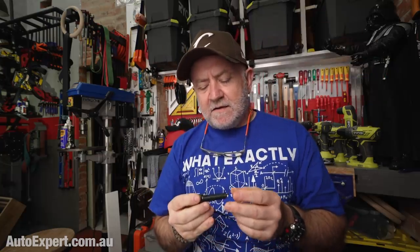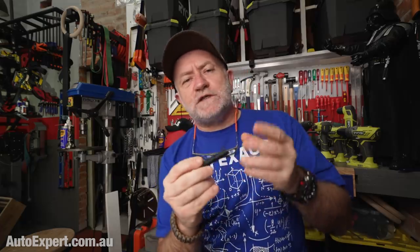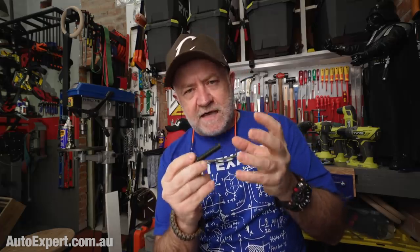Go to Google and look up the stress-strain curve for steel. You get a straight elastic region, then a little bump called the yield point, then it goes plastic in the curved region on top. Stress and strain really just mean load and displacement. In the case of a bolt, that means clamping force and stretch — you don't get one without the other. You don't get clamping force in any bolt without stretching it to some degree. You might not be able to see the stretch — it's not a rubber band — but it is measurable.